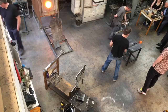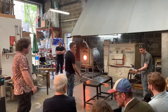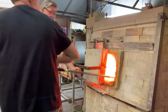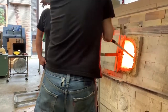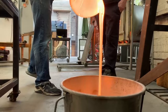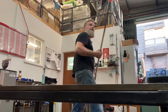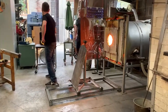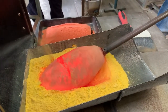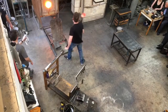You can see that air bubble sort of squeezed down — Louis is going to expand that up again now with a simple little puff. That's the final gather; it's a huge pot of molten glass inside that you dip the iron into to gather it out. Louis is applying the first colour now, which is a powdered yellow. Glass colour comes in various different grades — you've got solid rods of colour, and this internal layer is a very fine crushed powder. It's all glass, powdered glass, because it has to be compatible with itself.